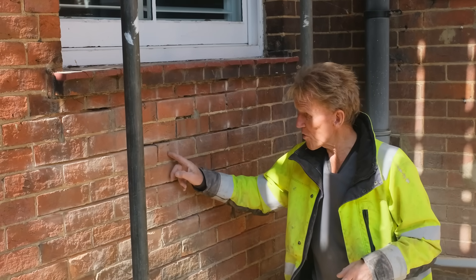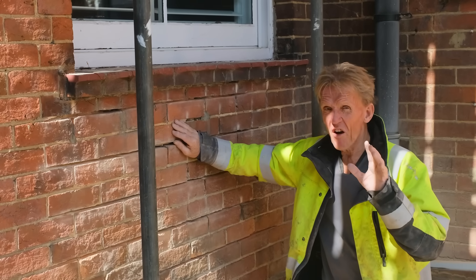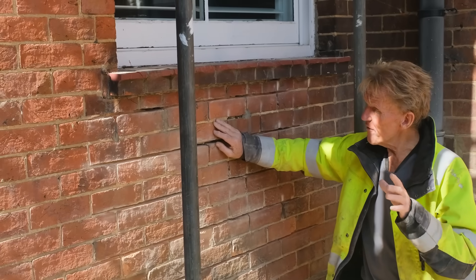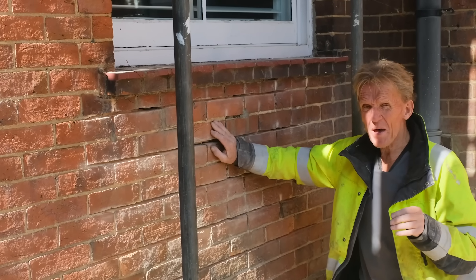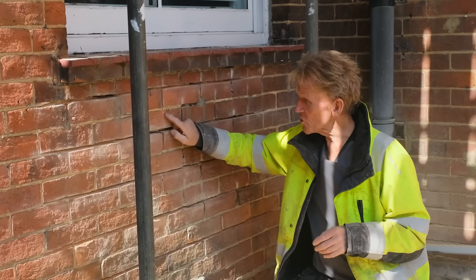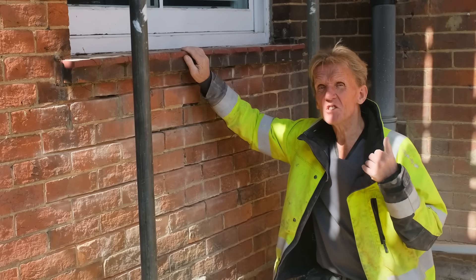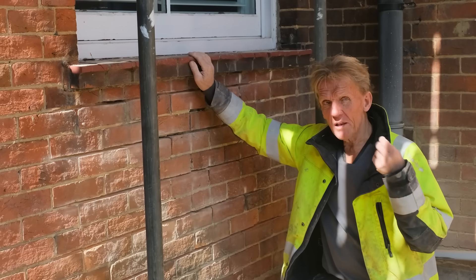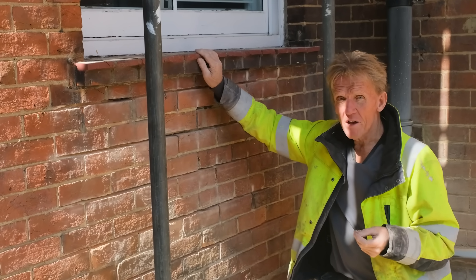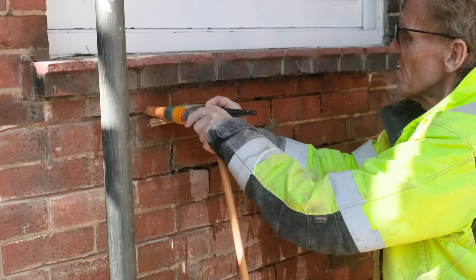If you've got sand and cement and a bit of movement you will find cracked bricks and you'll have to deal with those. If you can get replacement bricks that's absolutely fine; sometimes it's difficult so you can try secondhand ones. You could also buy some dye to put in the mortar and try to do a repair, but I find that doesn't really work very well and it tends to fade in the ultraviolet light. A little bit later we're going to find a cracked brick and do that repair for those interested in that part.